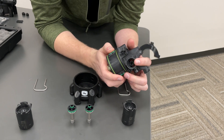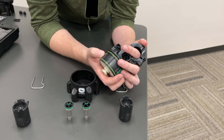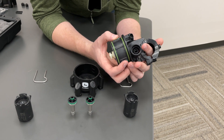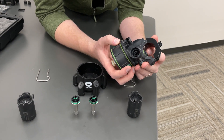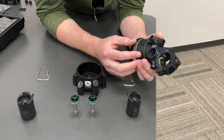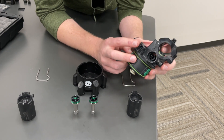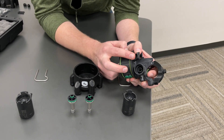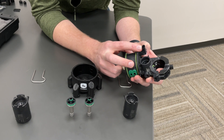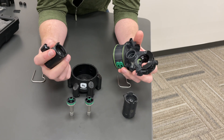We also want to make sure that when we're washing our sprayer, we use high-volume, low-pressure on the boom when cleaning. We don't want to be hitting these nozzle bodies with a high-pressure washer — just use low-pressure, high-volume to clean the boom and the electronics. While these are sealed, we can get water intrusion past those seals if we're using high pressure. If we do get liquid inside of these pins, that can cause them to corrode, and that corrosion will lead to a failure of one of your sides of your nozzle body and you'll get electrical codes on your screen.